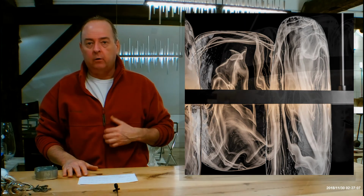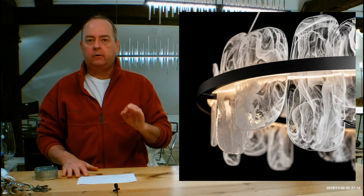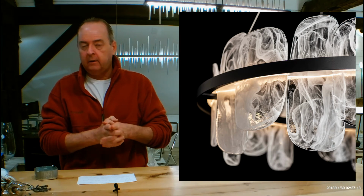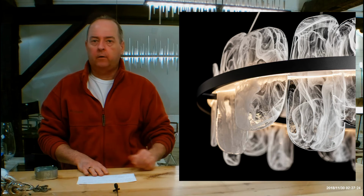So this is coming in at 50 watts. It's 2030 lumens, which is quite a bit. You're going to want to put this on a dimmer. Make sure you tell your installer, in addition to the fact that it's 74.8 pounds, that it's a dedicated LED fixture, so they're going to put a dedicated, correct dimmer on the wall for you.